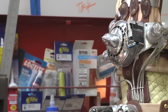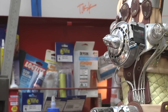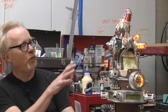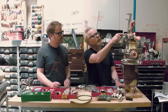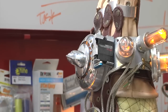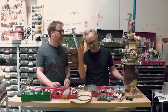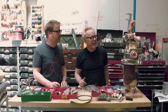I'm pretty happy with the results. You described that as one of the more challenging machining jobs you've ever done — the most challenging. I've never done anything with this many steps, having to think backwards through it. So there's lights in here — these are 12-volt grain-of-wheat bulbs, like from model train sets. There are 18 slices through the visible slot around the perimeter. I had to machine the inside first, then put it in the mill into an indexing head and cut the slices, then put it back onto the lathe to cut in until I got to the slices. Getting the registration right to get it back on the lathe after taking it off — that's not an easy job.